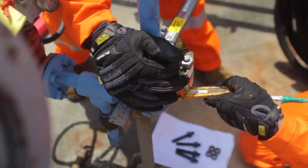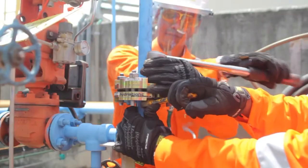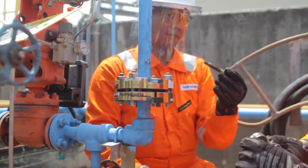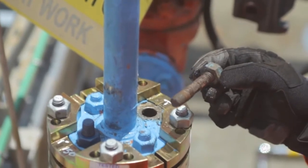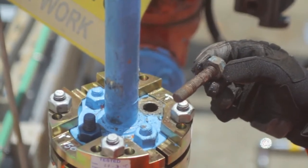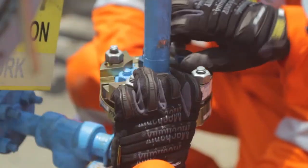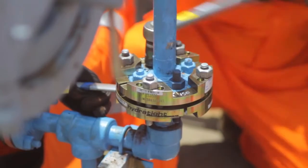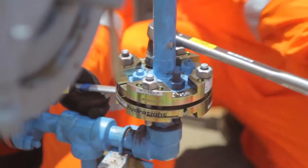Cutting back to our project, the MoreSafe has now been secured. The flange is stable. Starting with the bolt furthest away from the operator, each bolt is removed in a cross-pattern manner. No leak. This is a testament to the stability of the design. After each bolt is removed, they are replaced and torqued to 80% of the specified value. In this case, we have made an equal stud protrusion as per the customer's request. This process is then repeated for all bolts.